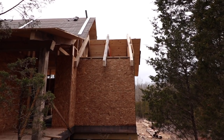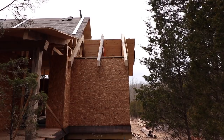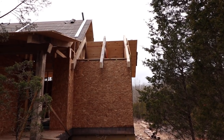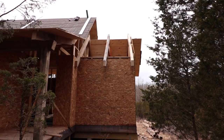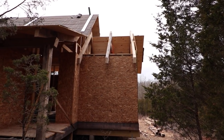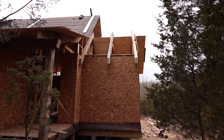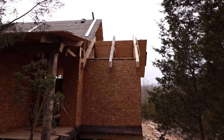That overhang is not how big the overhang is going to be, especially off the bedroom over there on the right. I'm going to cut that down later to the size that I want, but for now it's just easier to put the boards up in 10-foot lengths without cutting them. I'll snap a chalk line and come back and cut those ends off and get it looking clean.